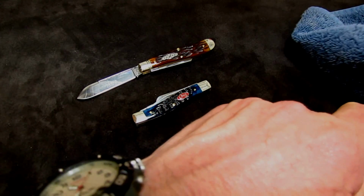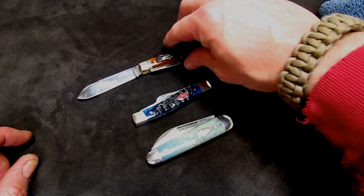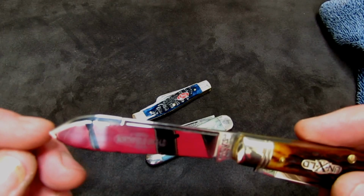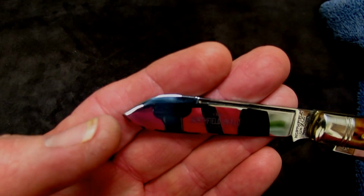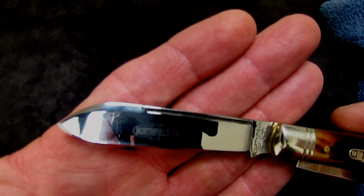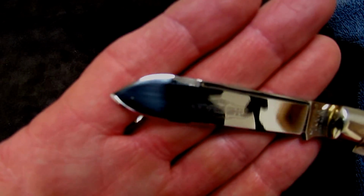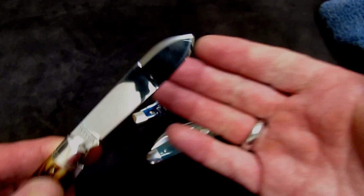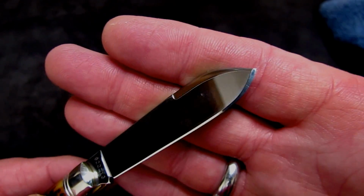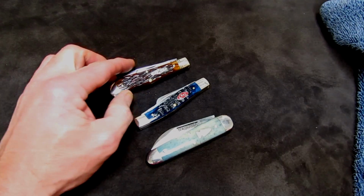And there's a way that GEC achieves this that's pretty cool. I watched their shop tour video on their site, and on all their blade blanks there is a tab of metal sticking off the tip, like 1/8 of an inch by 1/8 of an inch, a rectangular piece of metal that stays on there all through the manufacturing process until they're ready to put the edge on and put the tip on the knife, which I think is so cool. It doesn't get beat up during the process. That tip isn't finished until the knife is sharpened. So they get really crisp tips, especially on their clips and their Wharncliffes. I really, really like that.